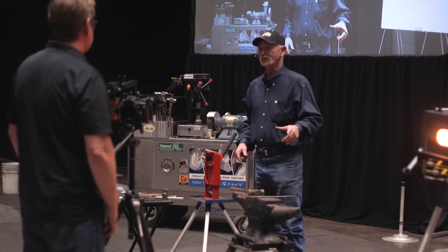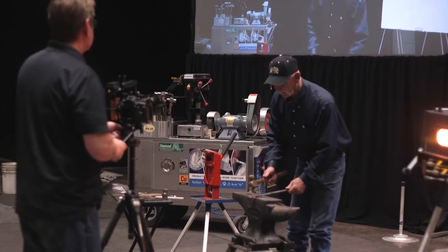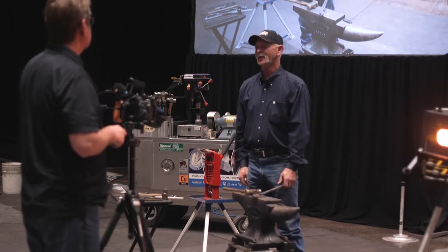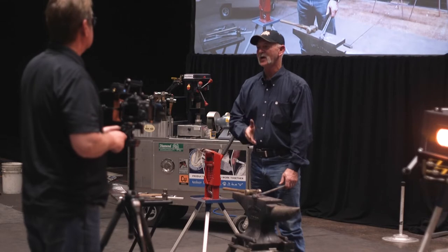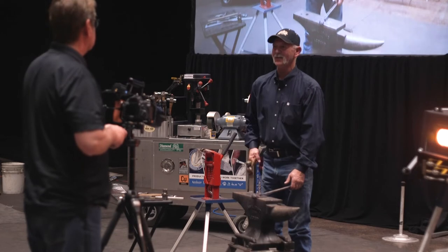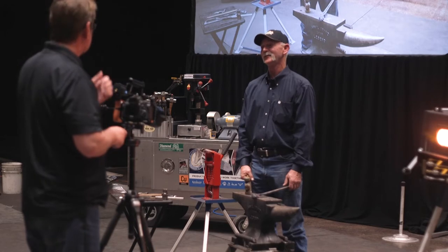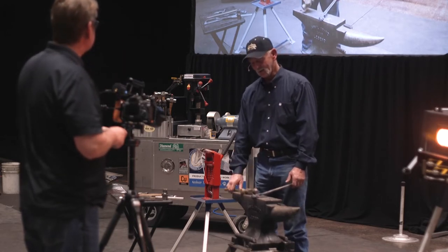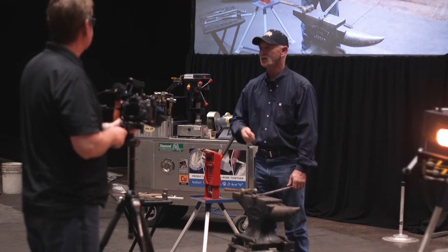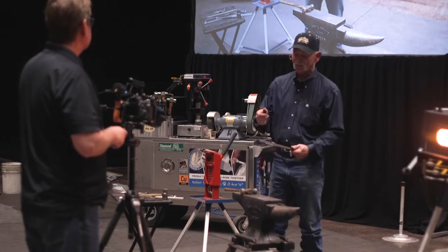And then when he went to put his rivet in, I noticed what he did. The first thing he did was take his hammer and push the rivet away. He actually bent the rivet. And then I watched him pull it back to the center. And I was like, that's cool. He says, well, it's really easy to pull the hammer this way. It's really hard to shove the rivet that way. And I go, very true. So he would just knock the rivet away and then pull it back to center. And it works really cool. Every time I put a rivet in, I think about that.